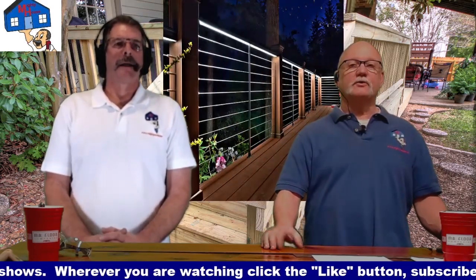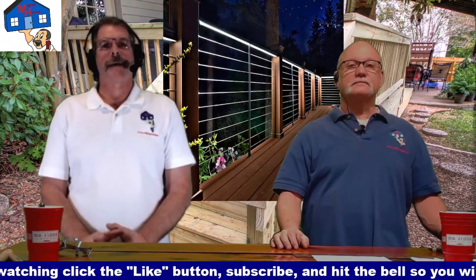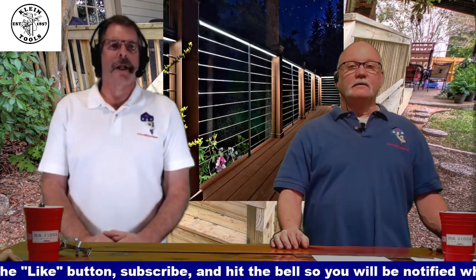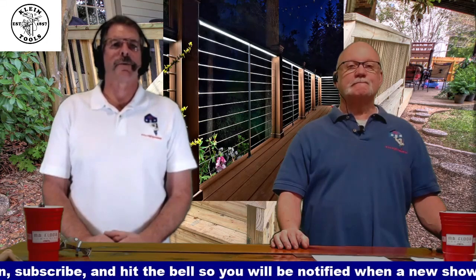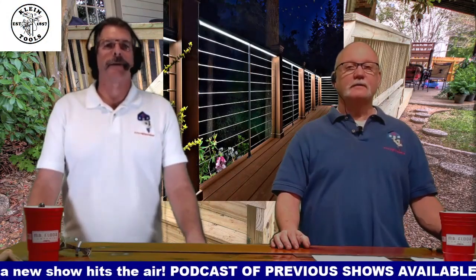And then you can also do an under-rail — strip lights, yes. There's a lot of LED tape light available now, color changing and all of that. What's even nicer is there are all kinds of aluminum channels that you can plow into any of your woodwork. They put lenses on there so you don't get the LED spotlights — it diffuses it with a little white diffuser, giving you that type of glow. It's a little more money, but it does give you a much nicer finish. That's a clean, contemporary look, and it's all down lighting too, so it's never going to be in your eyes. It's going to illuminate everything and make it really soft and inviting.